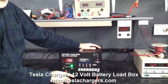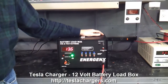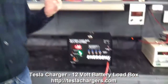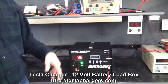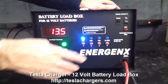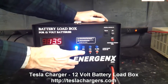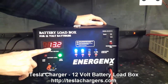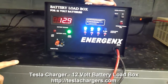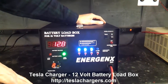Let me show you what happens. This battery is sitting at 13.6 volts right now because we just topped it in another demonstration — normally these batteries would sit topped at 12.6. As I push one of these buttons, it puts the 4-ohm load on and the light comes on. You can see the battery starts discharging a little bit. I put another one on, and these numbers start coming down more. Then I put the 12-amp load on and now it starts coming down a lot — that's 3, 6, and 12, so 21 amps altogether.